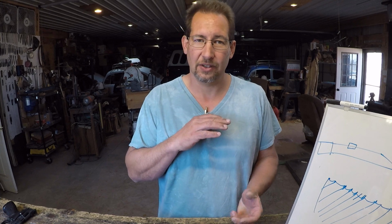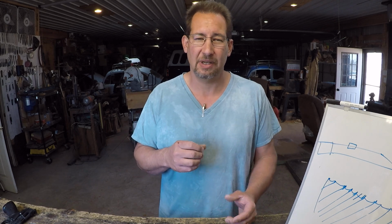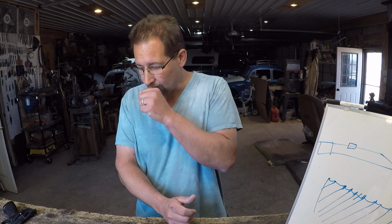Typically, you clean them with Dawn and water and a toothbrush, that's for diamond stones. For your natural type stones, typically it's either a diamond resurfacing block, basically an old worn out diamond stone, or loose silicon carbide powder on plate glass. Those are about the best 2 ways to do it.